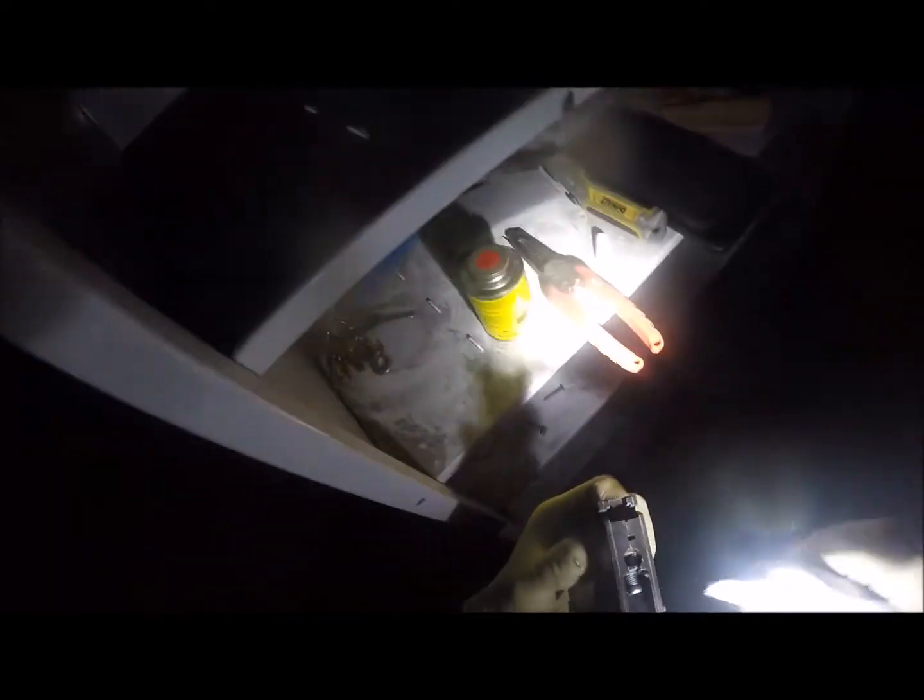And yeah, I could strip that a little more. A lot of times these don't go in there that deep. That's the reason I don't like to strip them too long. I've seen some where they just strip them way too much, but I don't like to have that tail hanging out. See, that's over 1/2 inch long here, right? I stick that in there and you see how it sticks out just a little bit. Although that's fine, I just don't like them sticking out too long where you have an exposed leg.